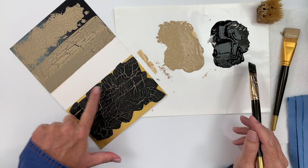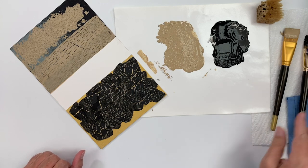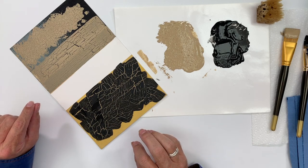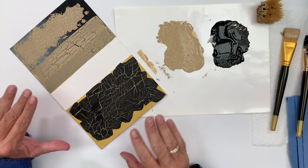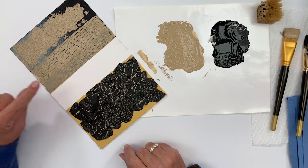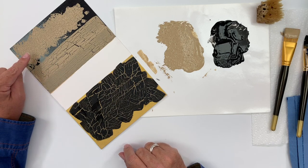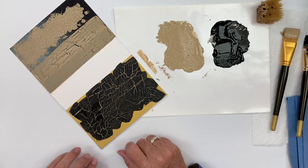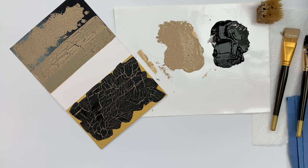As this continues to dry, we're continuing to get these beautiful crackle effects. I want to recap a couple of things. The most important thing is to leave your top coat alone — don't go back and try to add a little something to it, because all you're going to add is problems. Put it on, leave it alone. We've stroked it on from side to side giving the traditional crackle paint effect. We've applied it using a natural sea sponge to get an overall crackle pattern. And then we've applied it in a slip-slap manner, which is easier to cover large surfaces without having to go back and mess in a previously applied area.